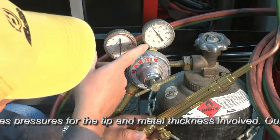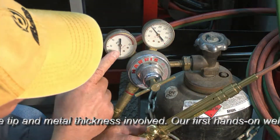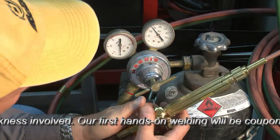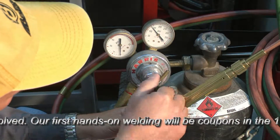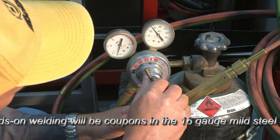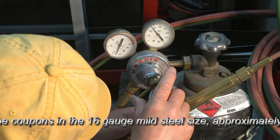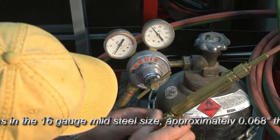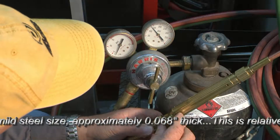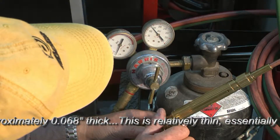The diaphragm's backed off, we have pressure in the tank — pressure from the tank reading on this gauge, nothing on this side. We're going to open this acetylene valve up slightly, about a half a turn, to stabilize the pressure at 3 psi. Gradually turn this up to 3 psi — you can hear the gas going. Turn it off; notice it jumped up slightly. Open it slightly, back the diaphragm off, and when I close that it jumps up slightly. I want it at 3 psi — that's about right.